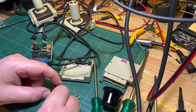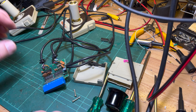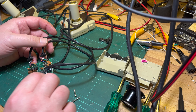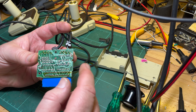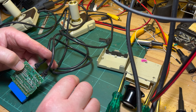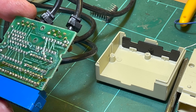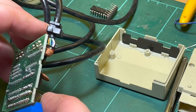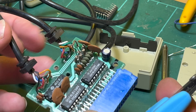The other thing I want to do is fix that up and fix this up, so I might pull these apart. What I normally like to do is add some fresh solder and then try desoldering it. The other thing you can do if the chip is going to be recalcitrant and you're not going to use it again - just snip it out. I think I might do that if possible.